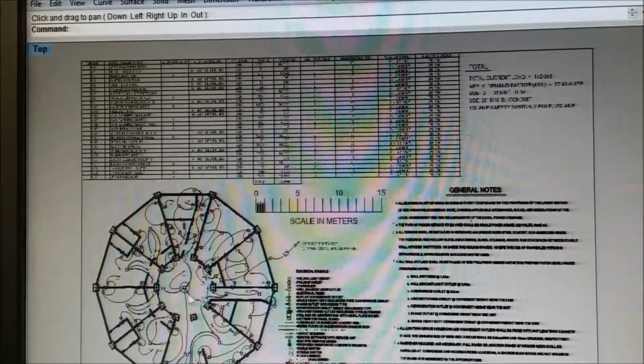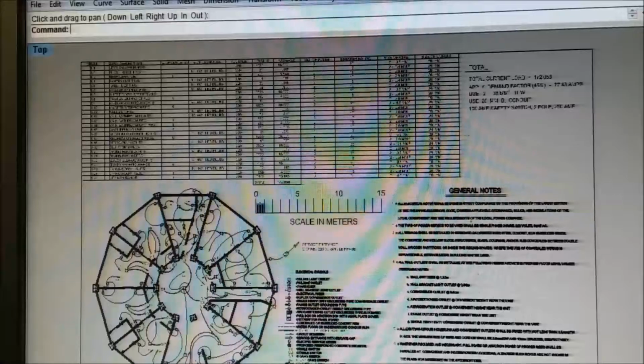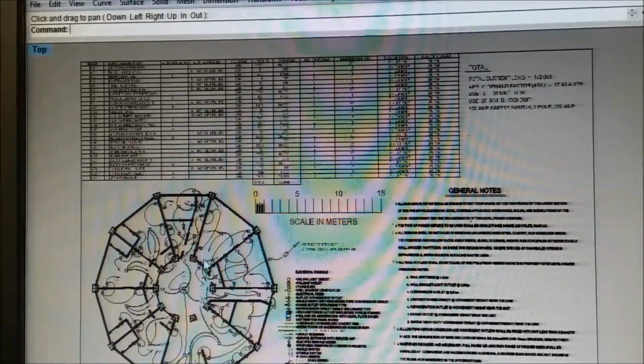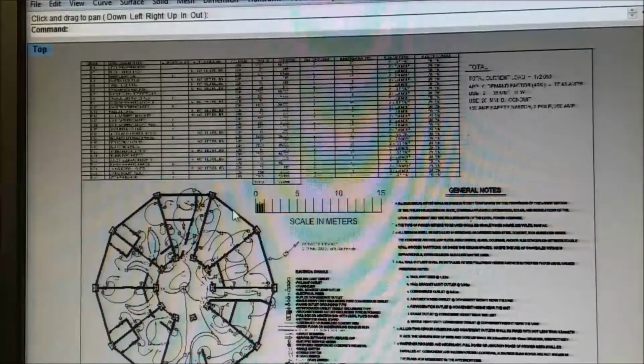See, the halls were drawn in there, in my opinion, for fire egress. Any room in the house dumped into the atrium. And from the atrium, you had a hall down here and right to an outside door. Outside door here, outside door there, outside door down here someplace. Anyway, they didn't like that. They didn't like the width of the halls. And then there was only one means of egress from a room, like here. You have a door coming out of that room. But they all go to a common place, and if that's where you're getting smoke, if somebody lights up a couch in there, then you have to go stand by the window until the smoke clears.